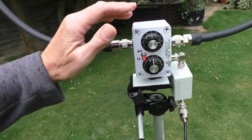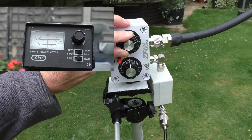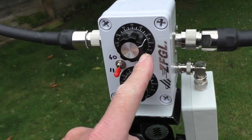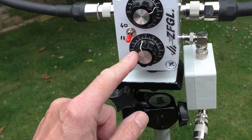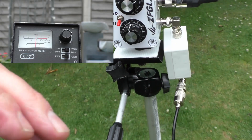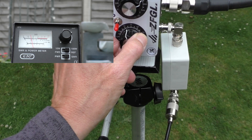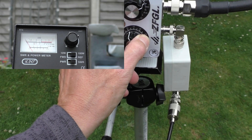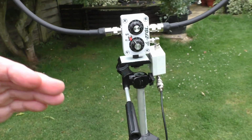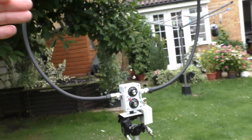I know it's very sensitive and you need to tune it and then move your hand away from the antenna because it does affect the SWR. Hopefully we'll be seeing that SWR meter come down. I've adjusted that as fine as I can, and now I can use the impedance matcher — the SWR control on the bottom — just to bring that down all the way. Turning it down slightly — you have to take your hand away because every time you touch it the SWR goes up — and pretty much getting a 1:1, maybe 1.2. About there is the sweet spot.